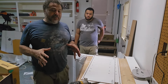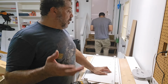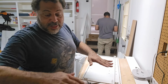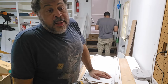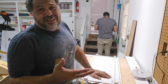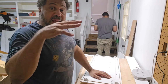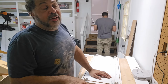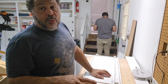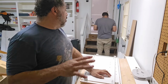If the bottom of the cabinet gets wet, because this is what happens a lot of times with cabinets, and had they gone through and gotten the cabinets refaced, they would have had a problem with the bottom of the cabinet dropping out because it is particle board. And they put basically either a vinyl coating on it, or it's almost like a plastic wallpaper on it. And if there's enough water that sits there, it penetrates it, and then the bottom drops out of it. And once the bottom drops out of it, it's really just wasted. So at least this is plywood. It should last longer, hopefully, than it would typically. So I like the construction of it.